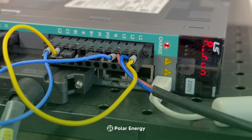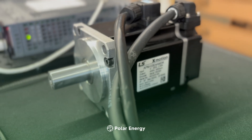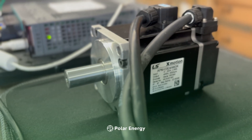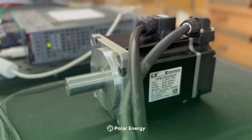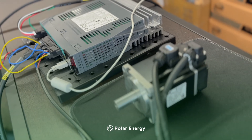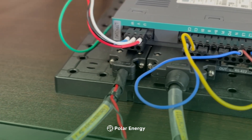You can observe the input signals, drive status, and motion progress directly in Drive CM. By using eight digital input keys, the LS P-Series servo drive allows for direct, manual control of servo ON, start, and multiple motor speeds, making internal position motion control simple and reliable.